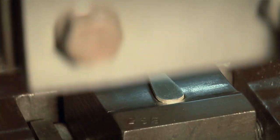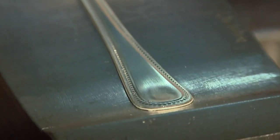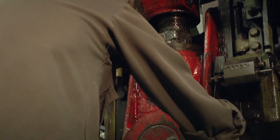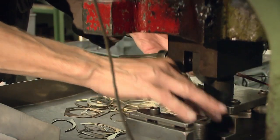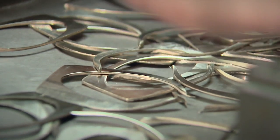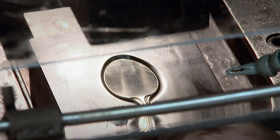The handle end is under the shanking press. Dies crash down and imprint one of those patterns we were talking about earlier — this one is called bead. The gentlemen in the spooning department have a lot of banging to do in their efforts to make the perfect spoon, and with each one of these thuds the outer edge of the bowl is defined and the excess kept back for recycling. The bowling press gives the spoon its characteristic cream-scooping shape.